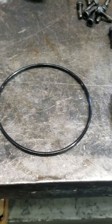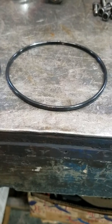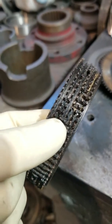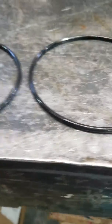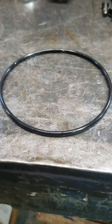From Hale Marine again. What we found today in this transmission is we weren't getting a good apply from the input shaft clutches. You can see that they actually welded together solid after less than an hour of running. Somebody else built this and we're doing some patching up on it right now.